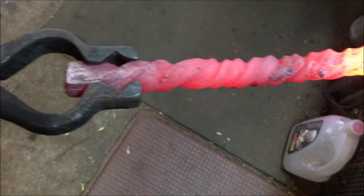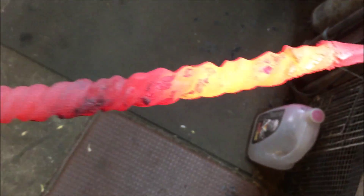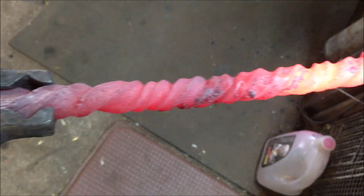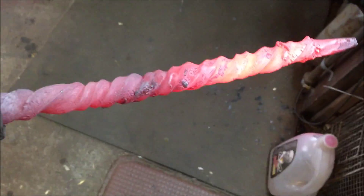There's my piece — it's about a 150-layer billet, all twisted. I'm going to bring it up to temp, put it back in the press and kind of flatten it out and see what it looks like. Stay tuned.